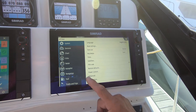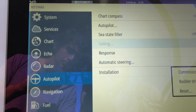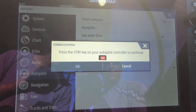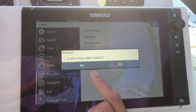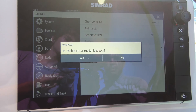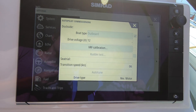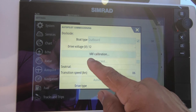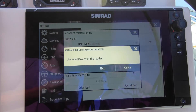I'm going to go to Autopilot in Settings, then Installation, then Commissioning. It will ask you to take control by pressing the Standby/Auto key, then press OK. We need to enable virtual feedback because this boat doesn't have an actual rudder feedback — it has two outboard engines and uses the Virtual Rudder Feedback feature. We already have 12 volts set for the drive unit, with VRF enabled.